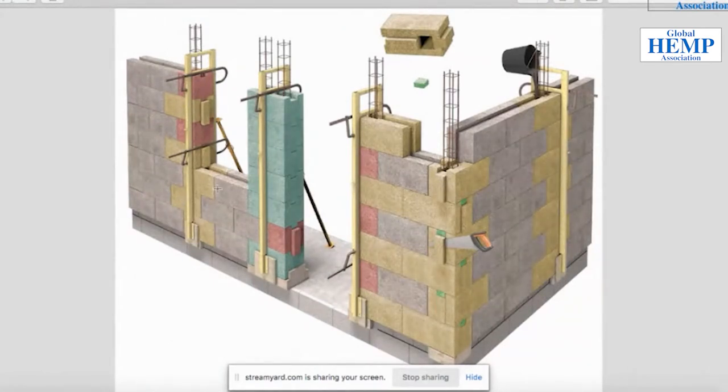In the system you've got all the blocks, window and door frames, and reinforcing steel for the vertical uprights, which is then filled with concrete. It's a pretty simple system. The blocks can actually be cut with a handsaw or a chainsaw. If you want to chase in services like electricity or water, you just mark that on the inside of the wall, put in your services, and then use lime mortar to fill in the gaps.